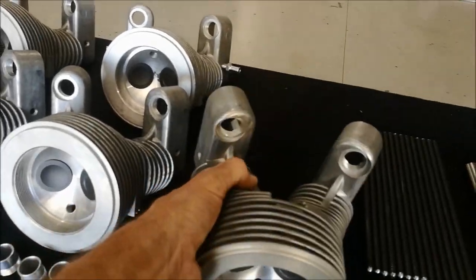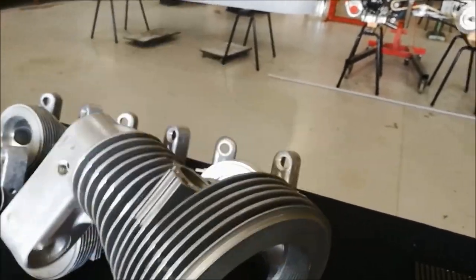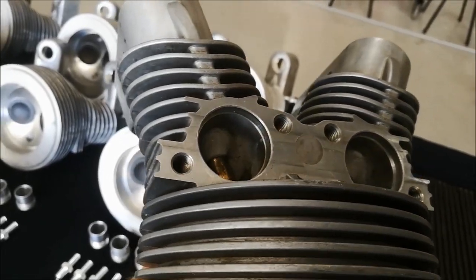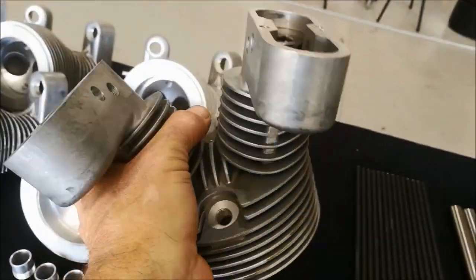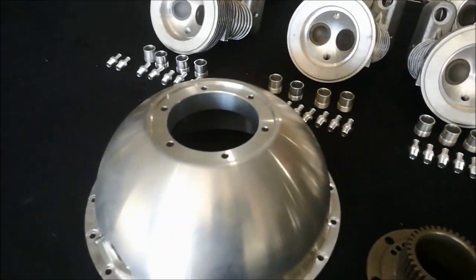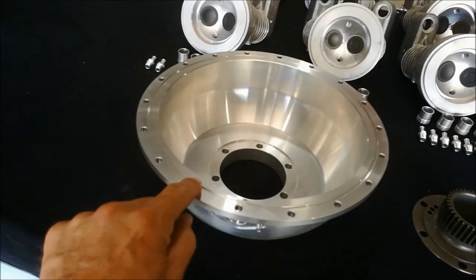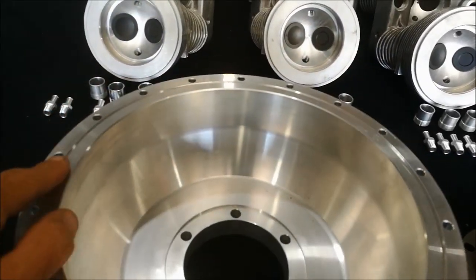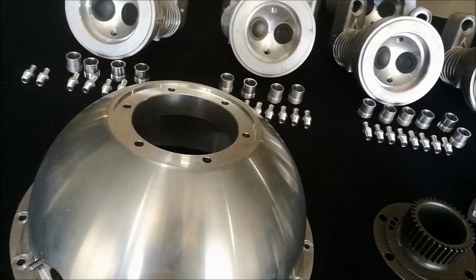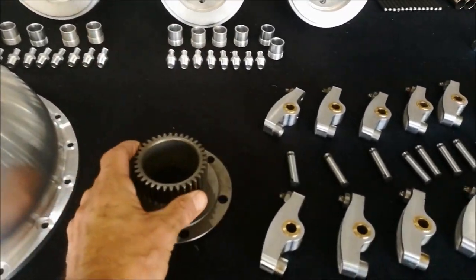This is basically a third generation of cylinder heads, starting from the billet head right through to the one I'm holding now, which is a pressurised die-cast head with die-cast collapsible cores — not sand cores — for the ports; they're all metal dies. The same valves. The nose bowl for both engines now has an O-ring groove to seal the nose case against the crankcase, along with a front oil drain, the sun gear, and the planetary gearbox.